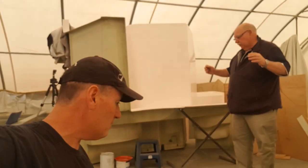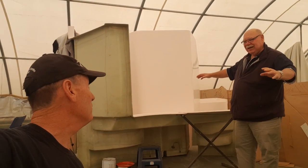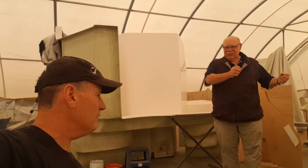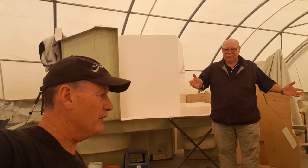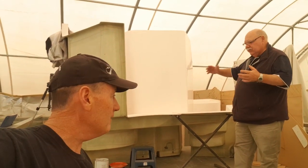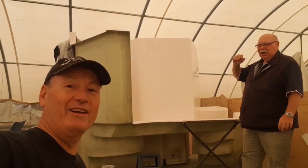Because, again, we talked about the balance on a catamaran, so the water. Yeah, we want to be able to equalize it. Same with fuel, I guess. If you're showering on this side all the time, you're using this water all the time. Five liters of water is 5 kilos. Yeah, makes sense. So either you have to use a ballast system or you have to transfer, use the other side.